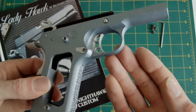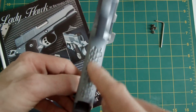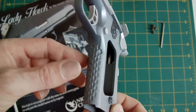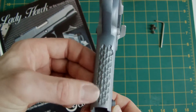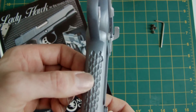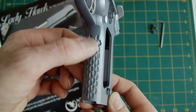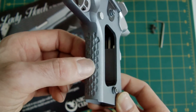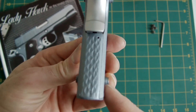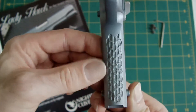It's gone together pretty well and it looks pretty good. I'm a little bit annoyed at the mistake that I made when I was grinding these out. I'm not going to scrap this frame purely because of that — it's just stupid — so I'm going to have to live with it. I would suggest that if you do decide to do this chain link grinding, take it exceptionally carefully, because it is a real tricky thing to do. I'd mastered it by the end, but at the start I was going all over the place and going too deep. Because it's plastic, it's easier to damage, whereas the metal mainspring housing has actually turned out very well indeed, although it's only lightly ground in.